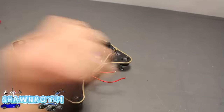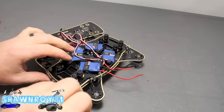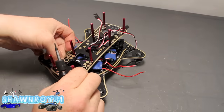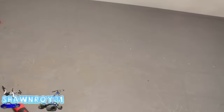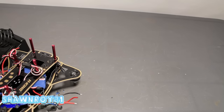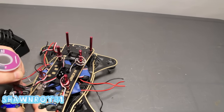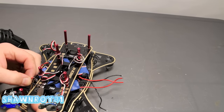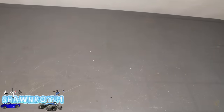Okay, so we're going to go with the leads inside and the power wires for the ESCs on the outside. Quick mock up here — put the screw and the washer above the dampener, which is going to separate our board. So we're just soldering the ESCs to the distribution board — negative to negative, positive to positive — and do the same all the way around.